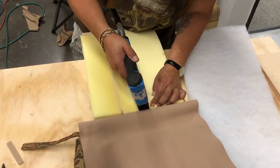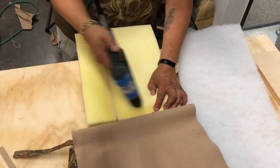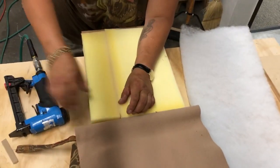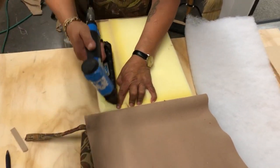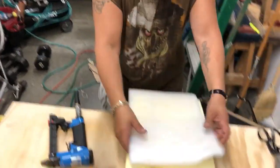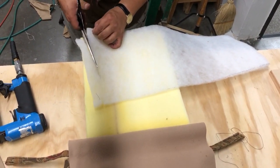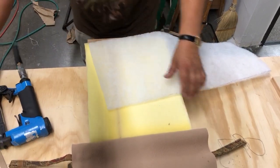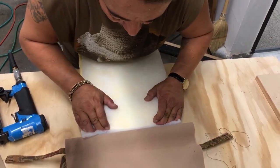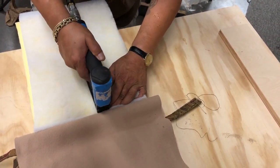So you can see he's tacking down the foam there, and he's really tucking it in there. He wants to get it tucked in so the customer has a real good idea of what it's going to look like. We want to show kind of a good representation of the crowning, all right? And that's also why he uses the Dacron material, because the Dacron actually will give the booth a crown to it, all right? So it'll give that cushion a crown, and it's pretty standard for the booths. They're not just straight up and down. Most booths that you sit against, the backing is rounded, and that's what we call a crown. So that's why we also use Dacron, right?